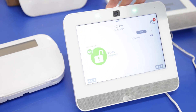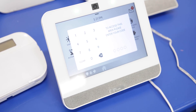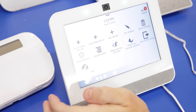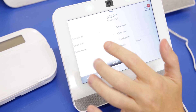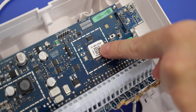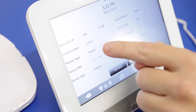We're going to come over to the IQ4 and get that paired. Go to the top menu, go into settings, advanced settings, enter in the installer code — ours is still the default, 1111. We're going to go to installation, devices, security sensors, and we're going to manually add this, so we'll do add sensor. Our source is already set to PowerG. We're going to do the DL ID, which is located right over here on our converter: 4603724.